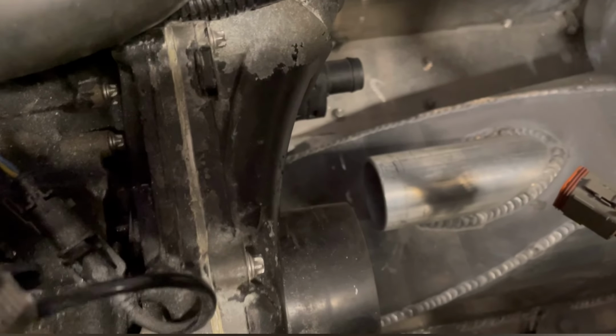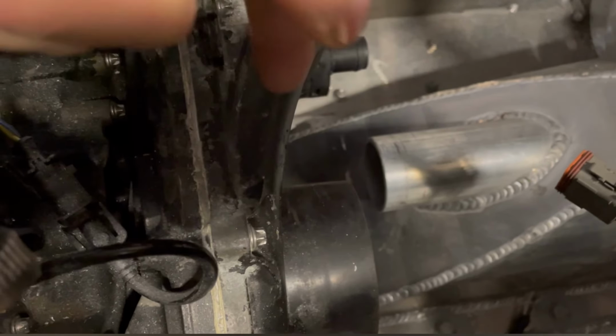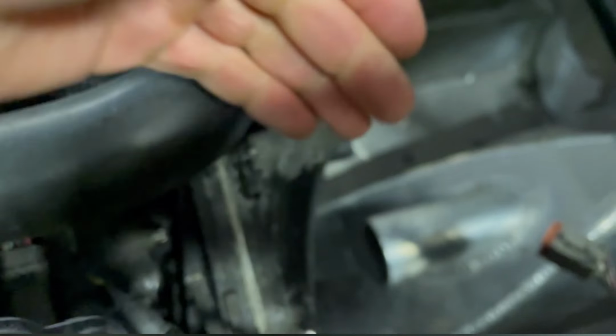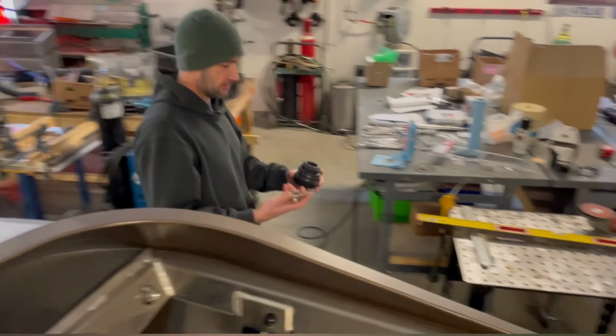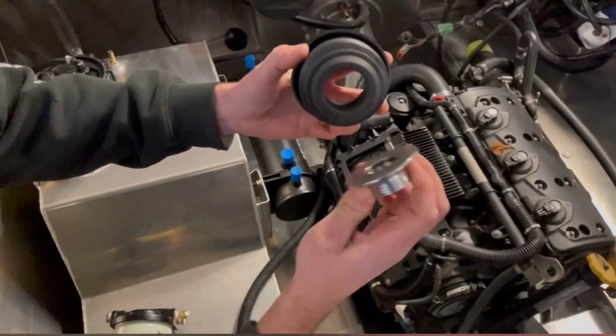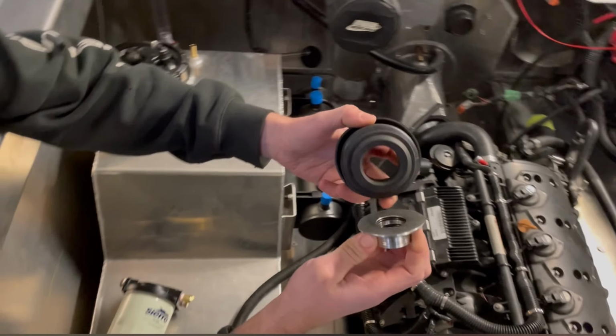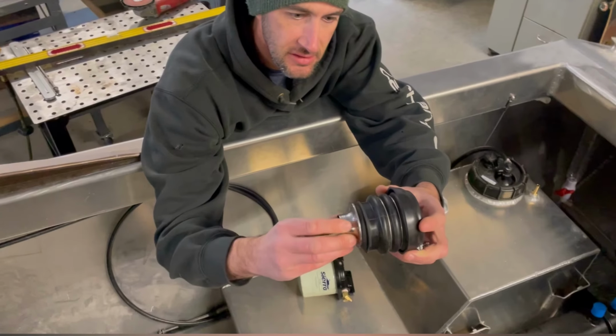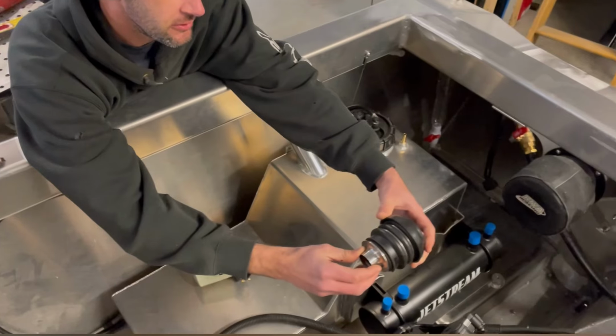That's it. But then again, you had to shorten this here. Yeah, and get the drive shaft, and before it was, the order was the stainless hat and then the carbon seal and then the drive shaft through to stop water from coming in. Yeah, here we go, you can show right there. This is your watertight seal. Carbon, completely machined, polished stainless steel hat. This right here is your watertight seal for that tunnel.